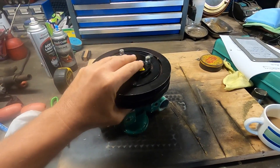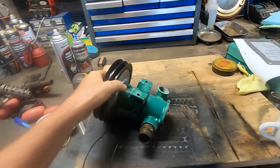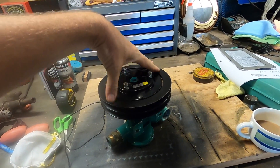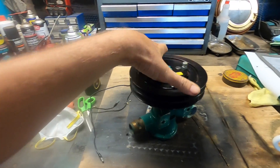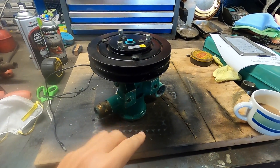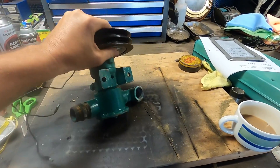The very cool thing about this particular pump is that it has an electric clutch on it. It's hooked to the engine to spin, but it doesn't actually turn the pump itself until current is supplied to the clutch — a bit like an air conditioner on a car. Then the clutch will lock up and it'll start turning the pump, so you don't have to be pumping water the whole time the engine's running. That's kind of cool, but it's an aside.